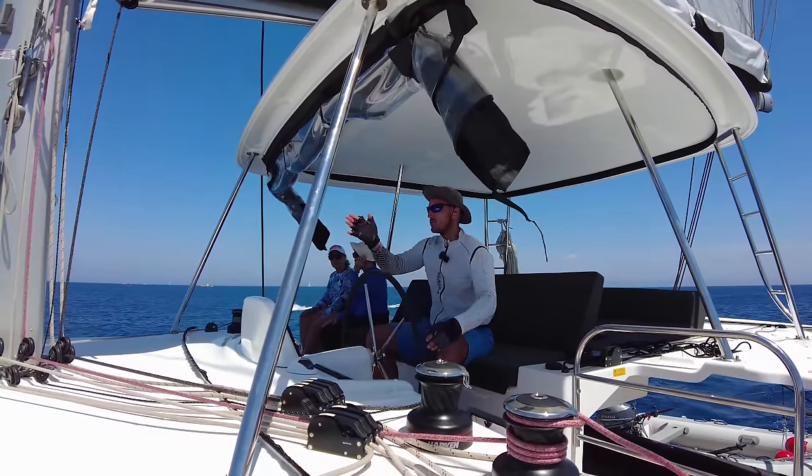Now the setting of the sail, so we have the traveler in the middle. Main sheet, it's pretty tight because we want to close the top of the sail. In low winds, you want to have power, so you tension the main sheet and you close the upper part, so no twist. And then we have the jib tensioned a lot, you see. Try to figure out these telltales. Now these are kind of happy telltales. Up there a little bit less, but in general, with the self-tacking jib, you can get these telltales normal, parallel upwind. For all the other angles, it doesn't work. And just, you see, slowly sailing upwind. Beautiful day, beautiful day.